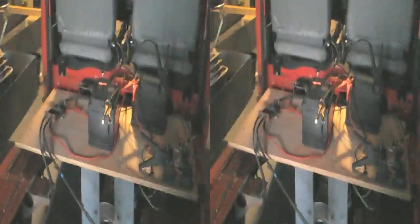Okay, so we've got the two batteries in there. You can see it from the back. See, there's two batteries basically. It's running off two batteries. Okay. And I've got a... this is a forward reverse circuit. It's the thing you can hear clacking because it's got two relays for either direction and you pulse one on for one direction, pulse the other for the other. Okay.